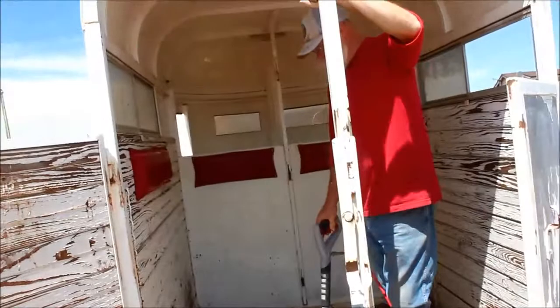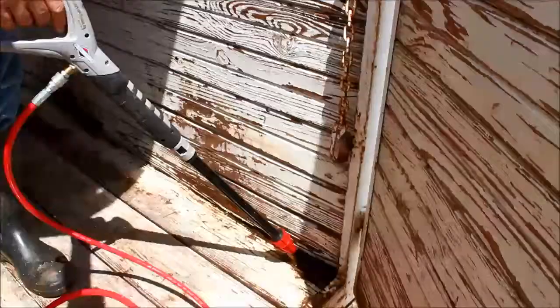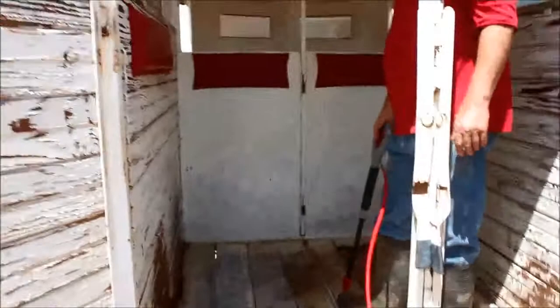This one seems to be in good shape. Got a little rot here along the sidewall. If there's anything in question, it's going to be these two end boards — this one and the other side — because there's also a little rot here, so this one I'm taking is going to have to be changed. They're just a two-by-six treated lumber, then painted. They're screwed in in a couple of places — I'm going to have to figure that out after I get into it a little more, but I want to clean it for now.